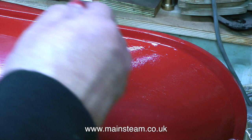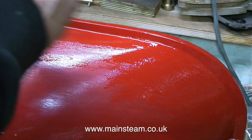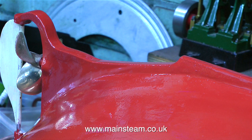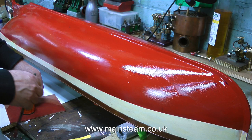What I'm going to be doing, once this paint has gone thoroughly hard after about a week, is rub down the new paint and the old paint on the entire hull, then paint it properly — one side at a time. It would definitely not be a good idea to paint the entire hull in one go, both sides, because I would have to lean across to do it, I would get drips and runs, and I would also get red paint all over my nice new T-shirt. And that's about it for the moment. I have to leave this hull until all the paint has really gone hard, then I can continue working on it. Thanks for watching, and I hope you found it useful.